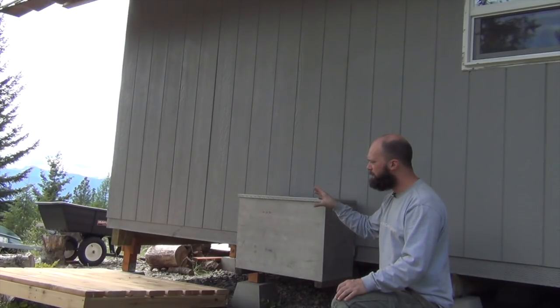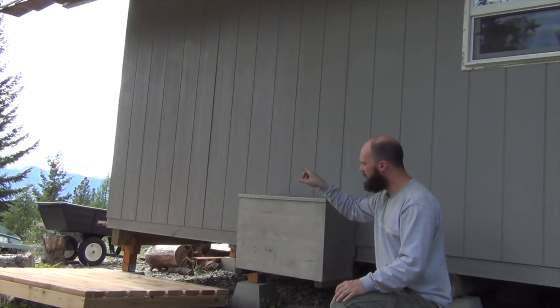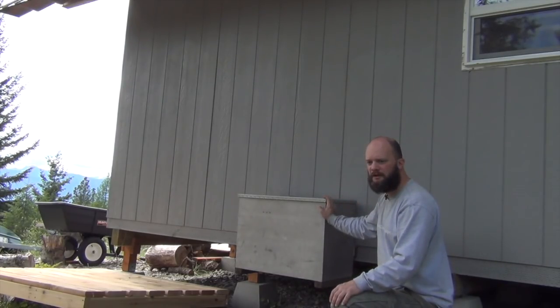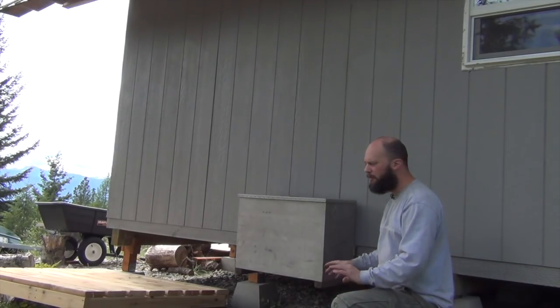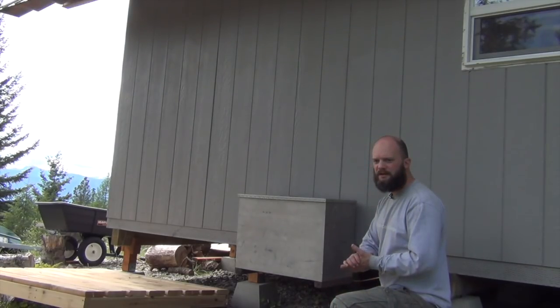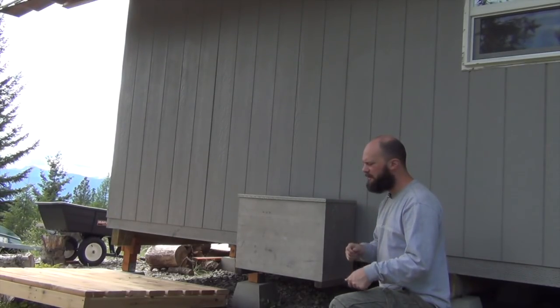But I have the shower, the propane shower thing. So this is going to have 1 propane tank that's going to go for the shower. The other one's going to go for the appliances indoors, which is the fridge and the range. So I have to hook these up together. I have a T-fitting, and I'm learning as I go here, but basically I'm using 3/8 inch OD copper tubing, and I think it's kind of thin wall stuff.